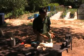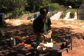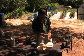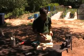You can also use a belt sander or any other grinder or power sander you have that'll cut down on wood. And round these off a little bit, like I did this one. As you can see, rounded like this. Doesn't have to be perfectly round, just enough to make the edges smooth enough so that it doesn't grab the pipe and cut it as it goes over it.